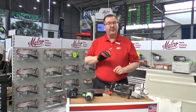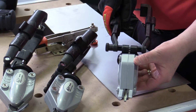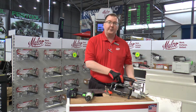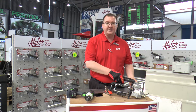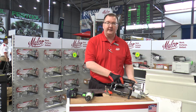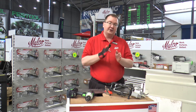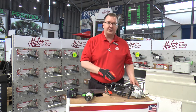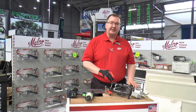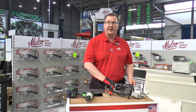That brings me to my third product, which is our Turbo Shear MD, model TSMD from Malco. This product provides a solution when you're cutting and want to use both sides of the metal after cutting. It has two cutting edges, each of high quality, so you don't end up with a scrap side. This product is better for flat metal stock and will cut up to 1mm thickness.